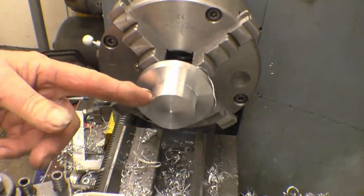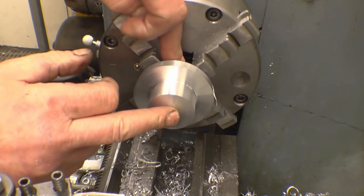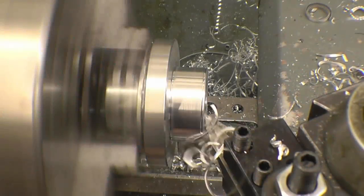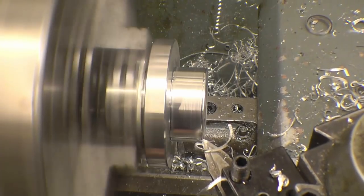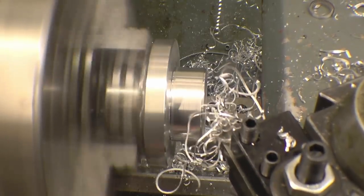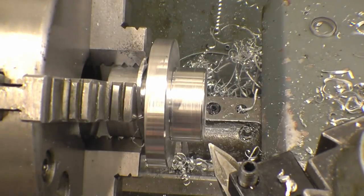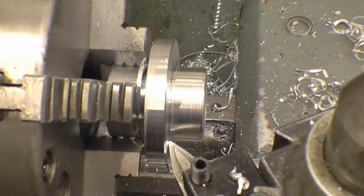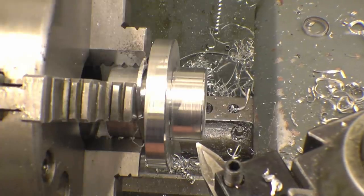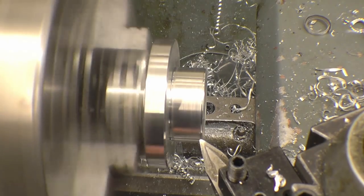Right, now I need that reducing down, I think it's 15 in an 8mm hole, put them in there. But I must make sure that the 8mm hole doesn't join up with a 10mm hole on that side, because I've used drillings that go in from various angles. What I can do is touch this off on there, zero the DRO, bring it back 15mm, which is there, one cut to see that done, and I'll do it in two.